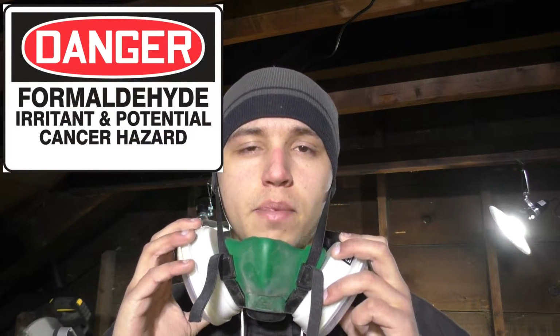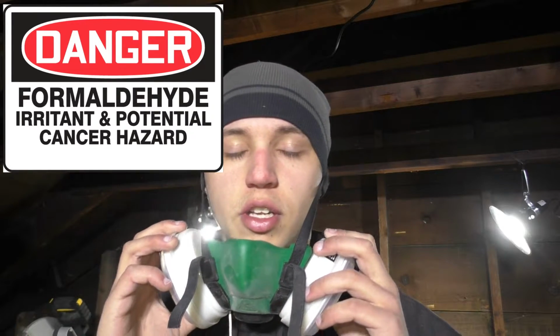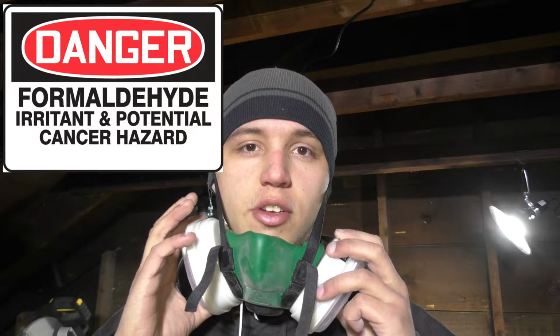Now remember, when working with MDF, there are very, very toxic binders, so make sure you wear a respirator, especially during the sanding, but you're also going to want it when you're cutting, drilling, anything where there might be particulates in the air. So make sure you got your respirator on and you'll be just fine.